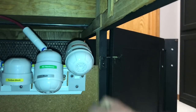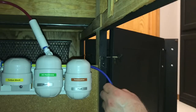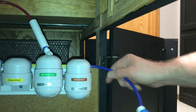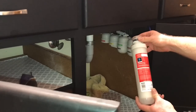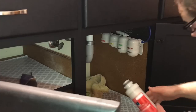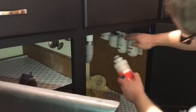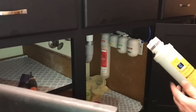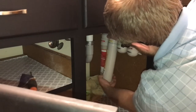Pull the clip out. I decided to put a longer piece on here because I want there to be the least amount of stress on this thing as possible. I'm just doing this in case water comes out — I don't want to get water everywhere. Make sure we put the clips back in. Now we need to install the cartridges. The first one is going to be the sediment filter — just pull the cap off, this is meant to be easier. This one over here is going to be a little tough, and it has little arrows here, so this is going to go like so. Next is going to be the carbon block — same deal, go ahead and push in and twist.